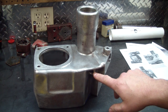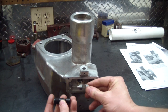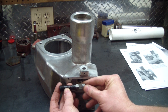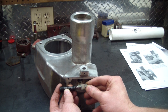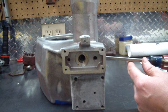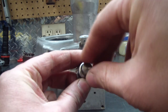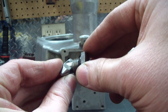In the casting here is a cross-drilled passage that goes all the way through it. In the passage is a shuttle valve and a lift valve, and I believe as this comes away it releases the fluid back into the reservoir, lowering the plow. Shuttle valve going in. The cable control hooks up to this cam-operated device which moves the shuttle valve. The cam lobe seats in the shuttle valve.